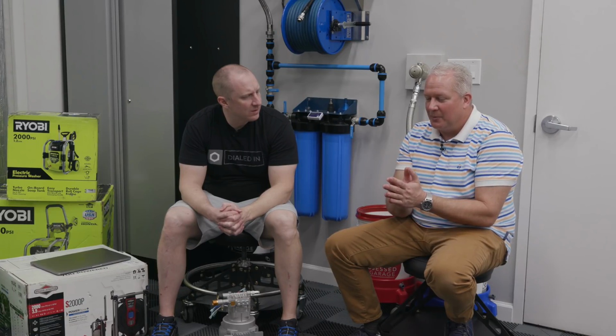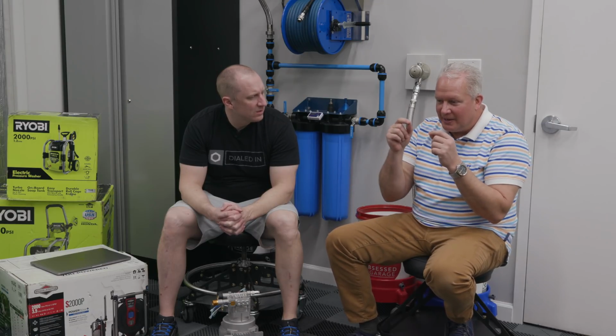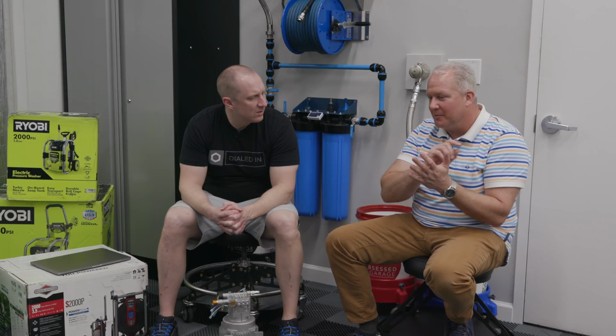There's a lot of different ways that you can rate pressure washers, right? PSI and flow, GPM, is the common standard. Back in '97, when everybody started working on it, and the standard came out in '98, a lot of the pressure washer manufacturers came together and said, how do we take out those variables? Where can you get the same consistent number for every pressure washer? It doesn't matter what hose, what nozzle, what trigger handle. How are you going to get the same number every time? They came up with the PW101, saying we're going to plug directly into the head, because it takes out every other variable. So that's the number you're getting, and it's a real number.